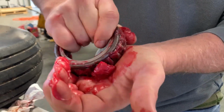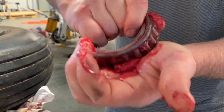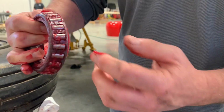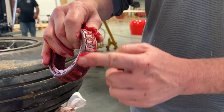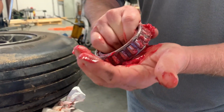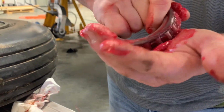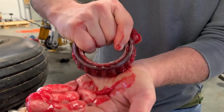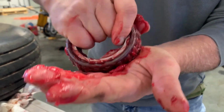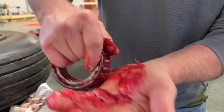You get grease in all the little crevices, because you want grease to come out of all these rollers, because that's what makes the wheel turn on the airplane. You don't want to have any trash or dry bearing without any grease, see it oozing out right there. If you get your bearings without any grease in them, then that's when they get hot and quit working.